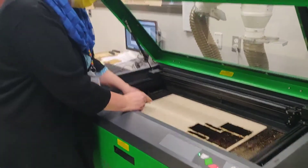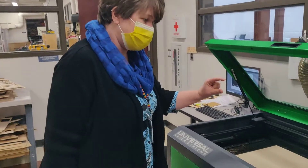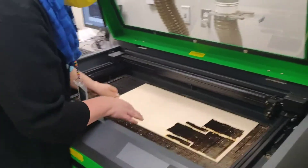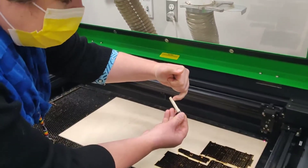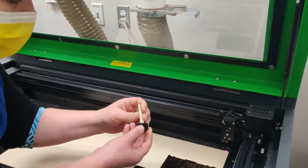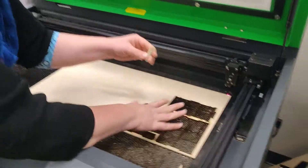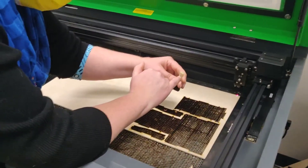I've set mine up to be cut right at a specific area within the setup when I sent it to print. One thing you need to do is focus the laser. This here is the carriage where the laser will come out of, and it needs to be exactly the right distance above the piece of wood. This is our focus tool — there's a little lip on it that needs to be exactly lined up with the bottom of the front surface of the carriage. Rest the bottom of the tool on the surface you're going to be cutting, then adjust the bed up or down so the front of the carriage rests just comfortably in that little nub.